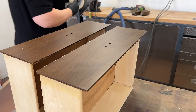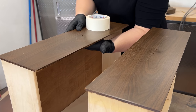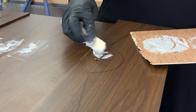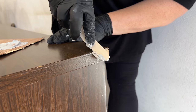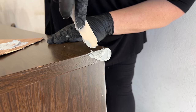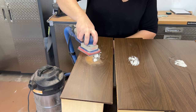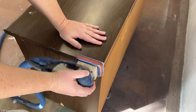When I got back, I knew the hardware holes weren't going to work with my new placement, so I put masking tape on the inside of each drawer and mixed up some epoxy-style wood filler to fill them all the way through. I used a bit more of the same filler to fix a missing chunk of edge banding and a couple of small scratches around the body. Once the filler was cured I sanded it smooth, then continued to scuff up all the shiny surfaces to create micro texture for my primer to grab onto.